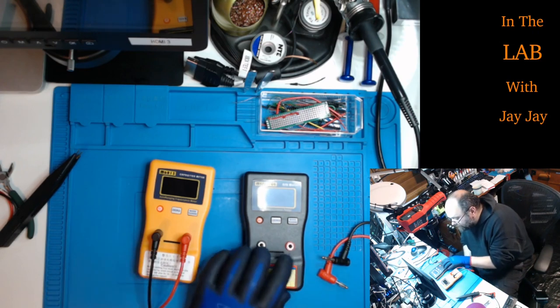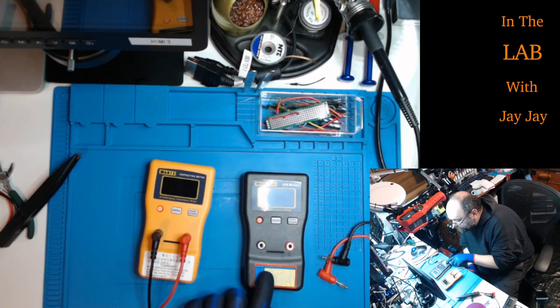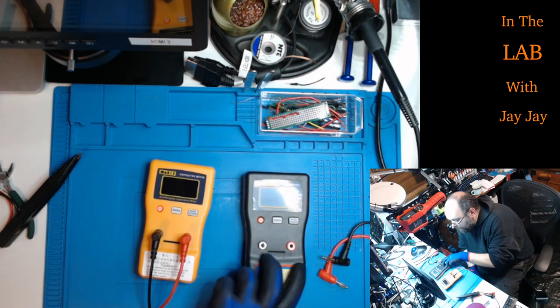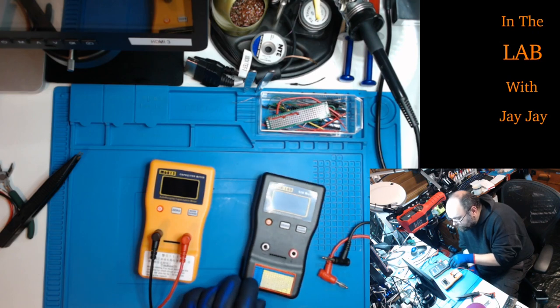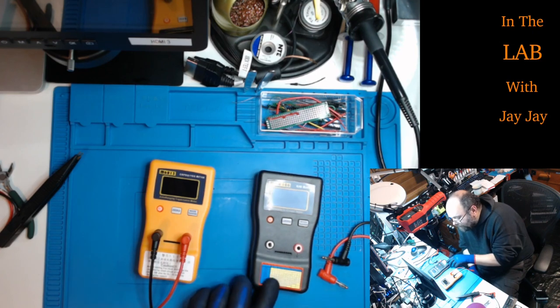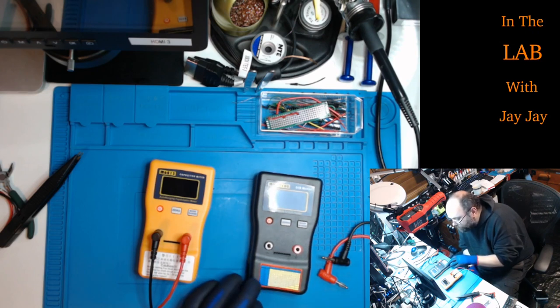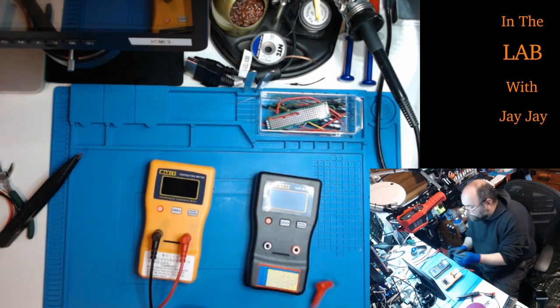Now this MESR-100 has a standard worst case electrolytic capacitor ESR table, and it gives you the voltage rating and the capacitance only goes as far down as 10 microfarads. So this guy's not really got any interest in low value capacitors. Anyway, that's good to know.